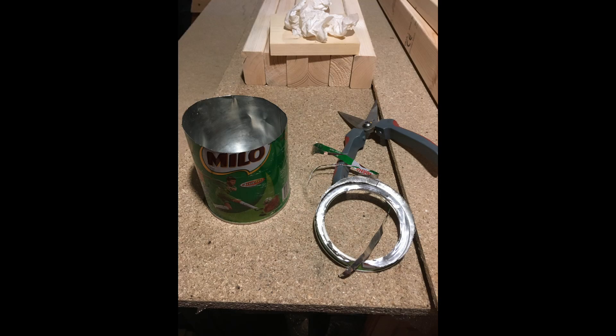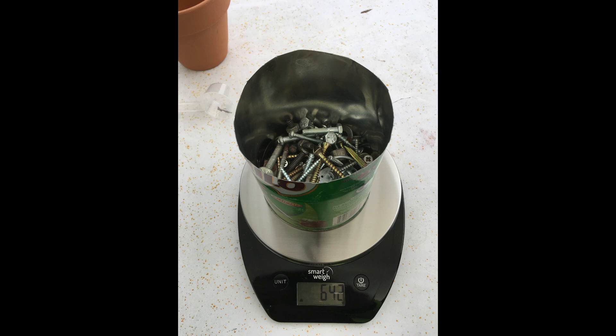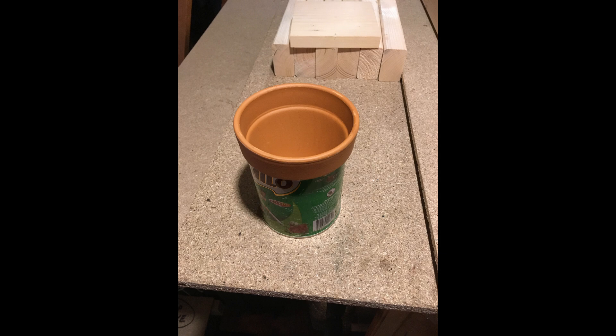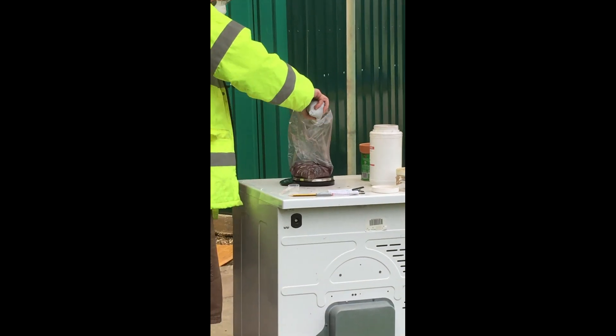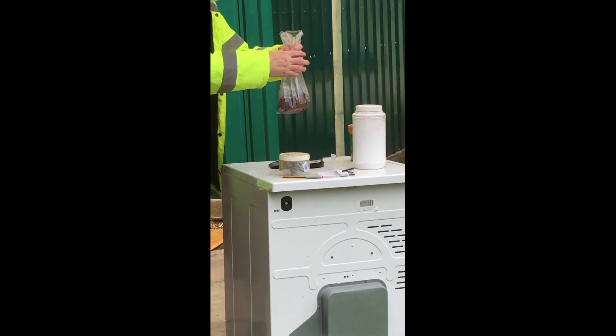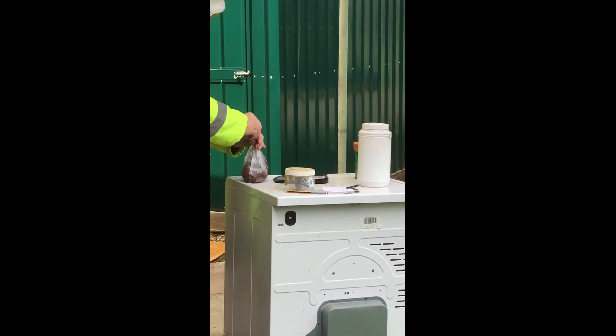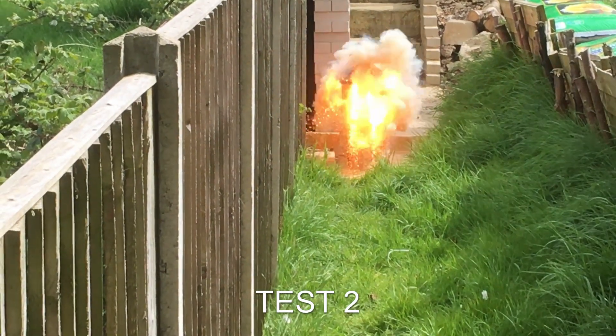For my second attempt, I tried to have the reaction melt extra scrap iron on the way down to the mold, with the thermite reaction held in a clay pot, and the clay pot held inside a tin can with scrap steel at the bottom. I made 1 kg of thermite again. To mix the iron oxide powder with the aluminum powder, I used a plastic bag to stop dust getting into the air. To initiate the reaction, I used a sparkler, which gives plenty of time to clear the area.